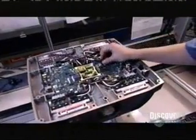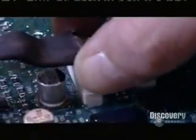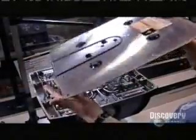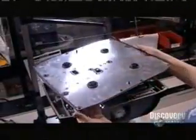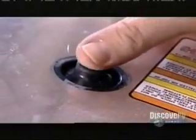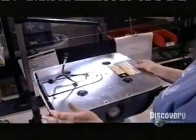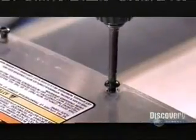Next come wire clusters called harnesses. They connect the vehicle's batteries to the control shaft. The chassis cover doubles as a floor plate for the rider to stand on. When you step on, your weight pushes 4 rubber buttons. These disrupt an optical beam on the controller board, telling the transporter it has a rider. The harnesses fit through holes in the cover, which attaches with 8 screws.